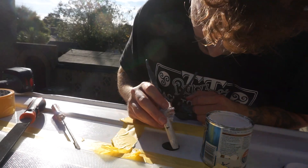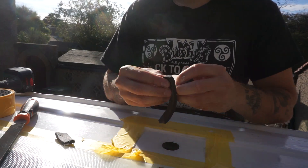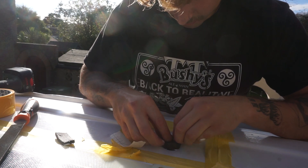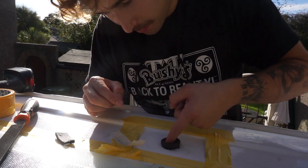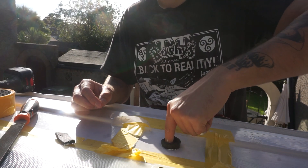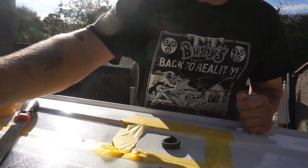You don't need a lot of sealant around the hole, just around the edges. Instead of conduit, the only thing I can use is some spare sound deadening material to put around the edge of the hole and feed the cables through, just so the cables don't rub on the metal. I'll also put some silicone around it once the cables are through and that should be it for this stage.